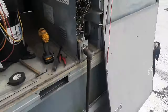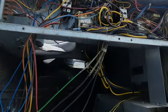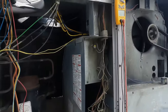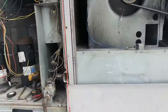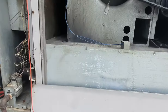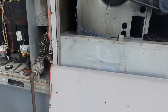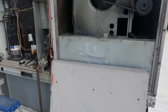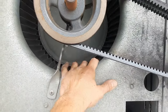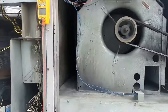They're gonna need some maintenance - they need filters, and it needs a cleaning. Maybe we can try to do something with this coil. I've seen worse but it ain't good. Let me check the freeze stat and see if I can secure those wires. Motor master's connected, we know we got a relay issue there that needs to go. They've been working on getting a bunch of these things changed out. The blower wheel actually doesn't look too bad.